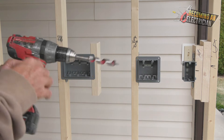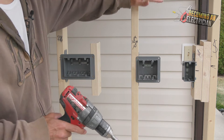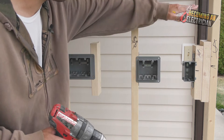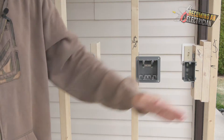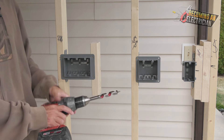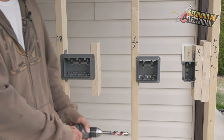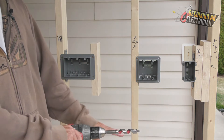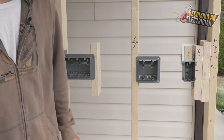Another thing when it comes to drilling: you want to try to get your holes as level as possible. You can have some up and down, but if you're way down here, then way up, then way down, it makes pulling wire way harder at long lengths. A cool trick I've learned over the years is to kind of rest the drill on your upper thigh. If you can drill at that thigh height the whole way, you know the general height where you want to drill. Shout out to Bob on that one.